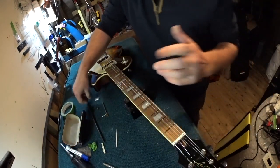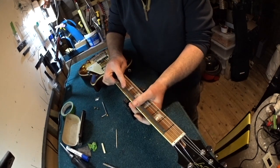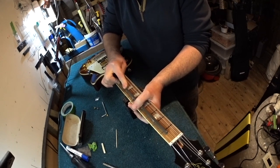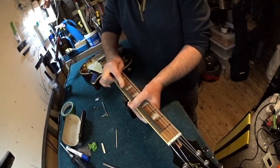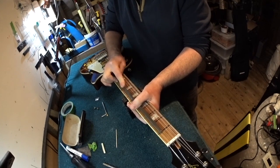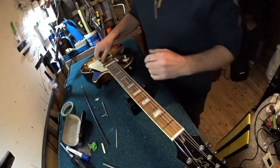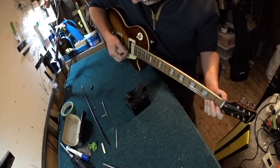Now, if that's the case, and that spot is a little bit low, I expect to find it again here as I level the B track. Now the reason I didn't recalibrate again is we're using the same calibration as the previous track, because on one of these 6 tracks, we have to use an outside edge calibration, which means we have to duplicate one. So I'm doing the same sort of thing again. I'm trusting that we've got a little flat section in the middle of the neck, and that we will encounter it. With a little bit of leveling here, we'll get to that point. So I'm feeling that just with that, we'll be into a nice set of playing notes.